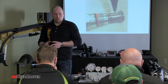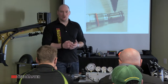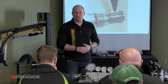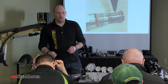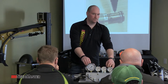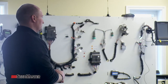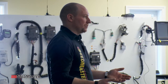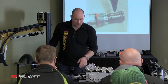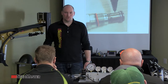After physically turning the valve in and out and still not getting pressure, we need to shut everything down. Float out the remotes on the tractor to relieve all pressures — we know we have gauges on every side of each circuit, both for diagnosis and for your safety. Use the remote to float, make sure they're off, and always shut the tractor off. Even if that customer is a 35-year standing friend — even if you do — is it worth the risk? Probably not.